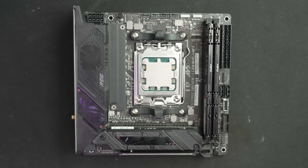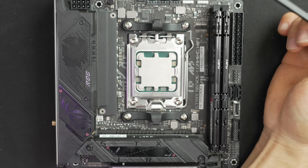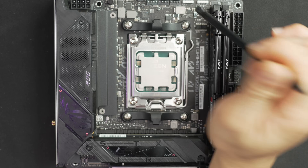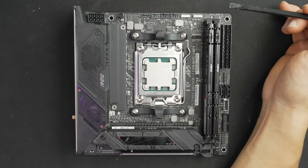Let's talk about the layout first, because that's the strongest feature of this board. Most ASUS boards have a similar layout, and it's very convenient. At the top you have your three fan headers — CPU, AIO, and case fans. Next, you have your 5-volt and 12-volt RGB headers. This one is ARGB Gen 2 compatible. And you have a set of debug LEDs in the corner — very nice.